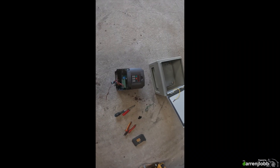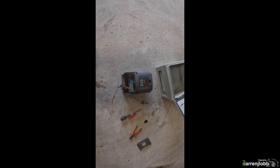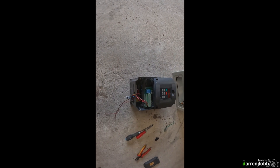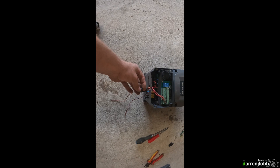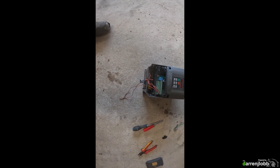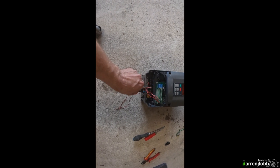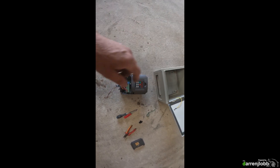I've just been on a trip down to the old workshop and managed to find the old VFD, still screwed to the wall where it was mounted. I'm going to stick this in an enclosure. You can see there's a pot sticking out the bottom — that was what we set our idle speed with — and two trigger wires on one of the inputs. Put that signal wire to ground and it triggers between full speed at 50 Hz and whatever low speed was set, just enough to carry away exhaust while the car's idling.